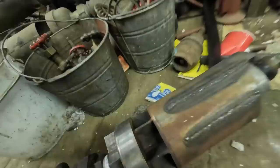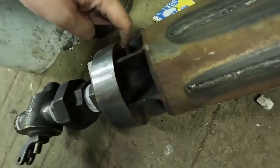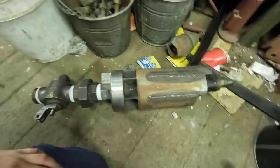You certainly can have tighter ones, or smaller diameters rather than larger ones, but the whistles tend to sound a little interesting if you do that. Ideally, the gap between the Languid plate and the bowl, this little slot here, will be centered on the outer part of the bell, so that as the steam rushes out of that gap, half of it goes inside the chamber and half of it goes outside the chamber. That will give the ideal resonance of the whistle. Because ultimately, a whistle is basically like a flute.